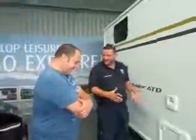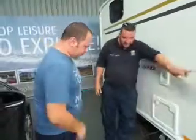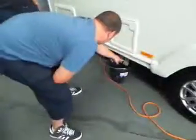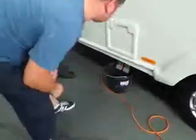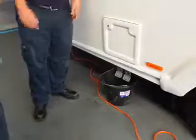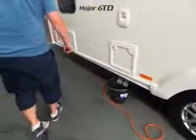The main thing is your toilet and everything's separate. So all your toilet is just this. Your grey pipes underneath are just for your sinks and your showers. There's two pipes here. Where do they go? Two of them or just one? Yeah, two. So you'll see there's a T on yours. So you push the two in and then it goes down to the one. So you just put the one into your waste. Okay, I think I saw that in the front of it.